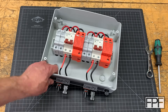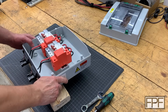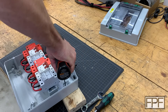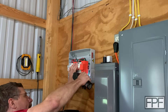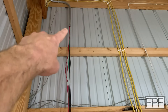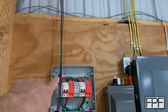All that's left to do is pre-drill some holes for our four mounting points while I'm still down here in the shop, then we could actually go put this up on the wall in the barn. I put just two screws in for now because I'm going to need to take it back off the wall once I'm ready to actually feed the conduit in. The conduit comes to that point right there, and there's a coupler, so I need to measure now, cut my last piece of conduit, drill this for the entry point of the conduit.